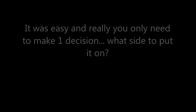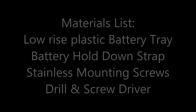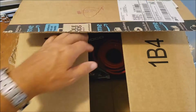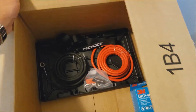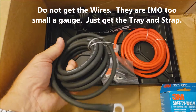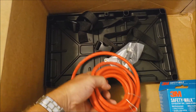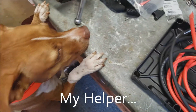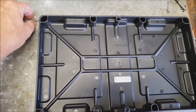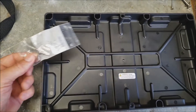You've got to figure out what side to put the battery on. Initially I was going to put it on the port side next to the other battery, but I realized how hard it would be to get two batteries in and out, so I decided to move it to the starboard side. I purchased a battery tray, some screws, and a battery strap. I also bought number six wires — do not use number sixes, get yourself some number fours.